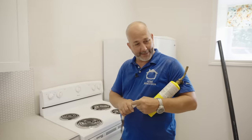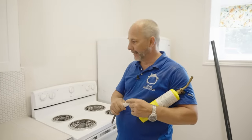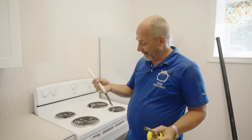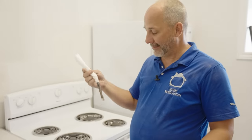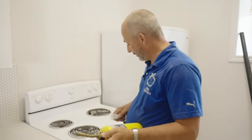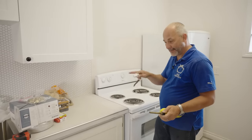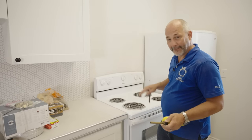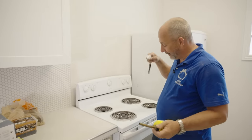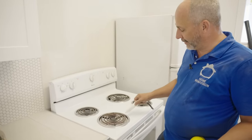I don't have a lighter today — it's not in my plumbing kit. These things happen. So I'm just turning on my stove. Taking a paper towel — one inch soaking wet, one inch isn't — so after I light my torch I'll step it out on the ground and we'll be fine. This isn't what you do every day, but once this coil goes red, I know it's good to go. I'm using map gas, which is great because it burns a lot hotter than the blue tanks.